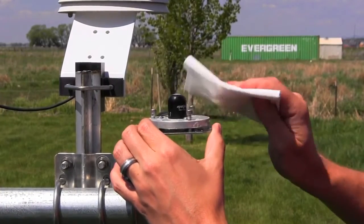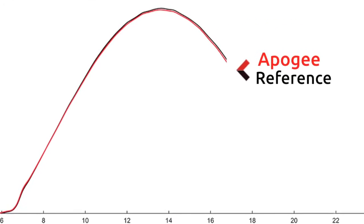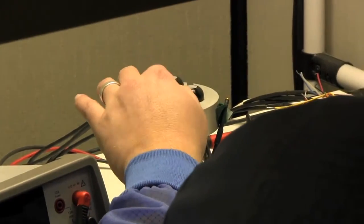The lens is made from acrylic, so avoid using cleaners or tools that are abrasive and can scratch the lens. The next step in your maintenance routine is occasionally checking that your sensor is calibrated properly. Apogee pyranometers have a long-term drift rate of less than three percent per year. For many applications this slight yearly drift is insignificant, however accuracy is important, so in general we recommend that you send your pyranometer to us for recalibration every two to three years.